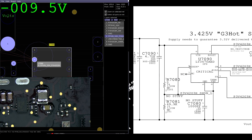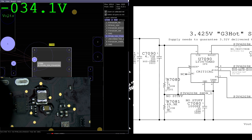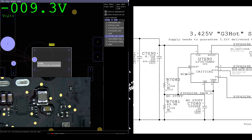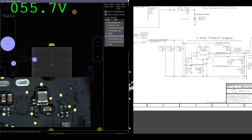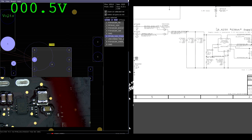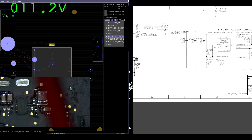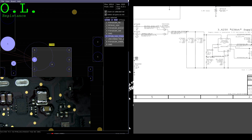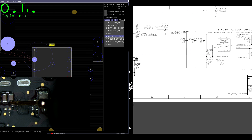As you can see, we have zero volts on input. Why is that not turning on? Maybe there's a short to ground on input. We've got three capacitors that go to ground on this rail, on the input that 3.42 volts apply. I'm going to turn off the charger and check to see if there's a short to ground on PP3V42 input.